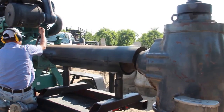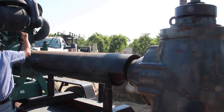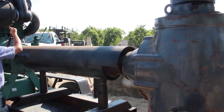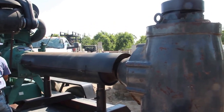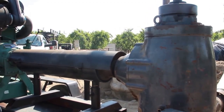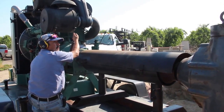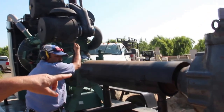What I have on two of my pumps is a ratchet head up here, so that as soon as that pump stops, there's a pin that clicks a ratchet and it doesn't backspin. Is that to save the well equipment or is it to hold the water up? Well, if you have a power surge, you have to have automatic — you have to have a backspin timer in there, so that it gives it two minutes to backspin before it will automatically start again. It's a safety thing to stop from tearing everything off.